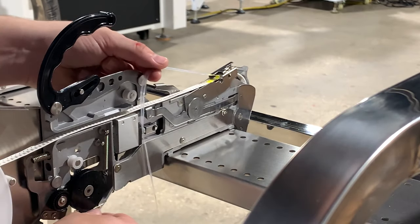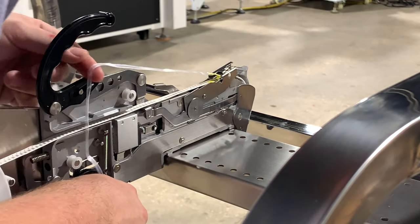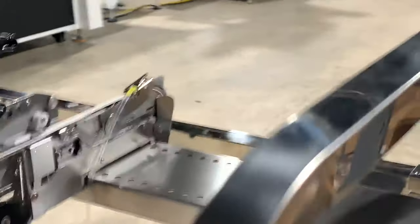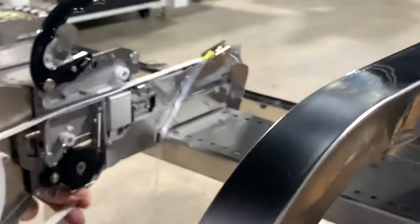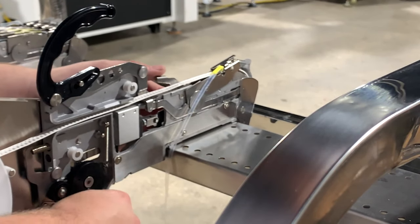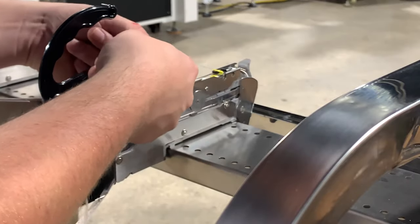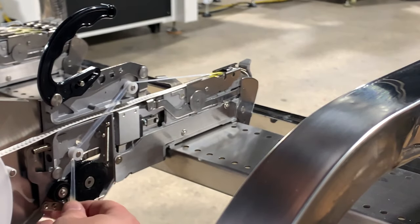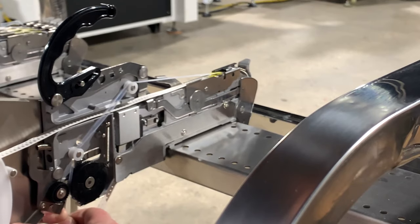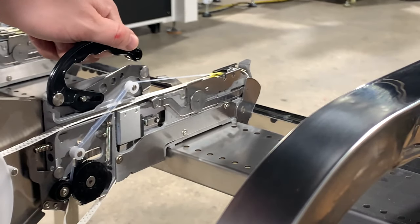Once we're in this position, we want to pull on this white component tape a bit until it feels like we are locked into the tape advance teeth. You can see the teeth are correctly aligned with the holes on the tape. Now we're going to press down on this button which releases our feeder lock, so the tape is now locked into the feeder. We then want to take our film, route it over these plastic wheels, push this little lever here, get our tape in between those gears, and now we can lock our feeder into position — this is what you would do to lock it onto the machine.